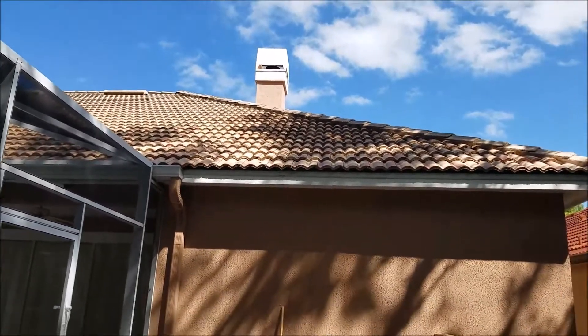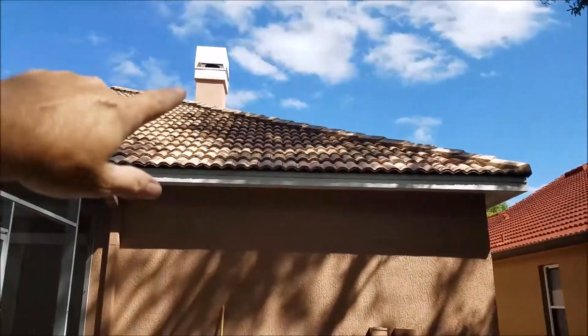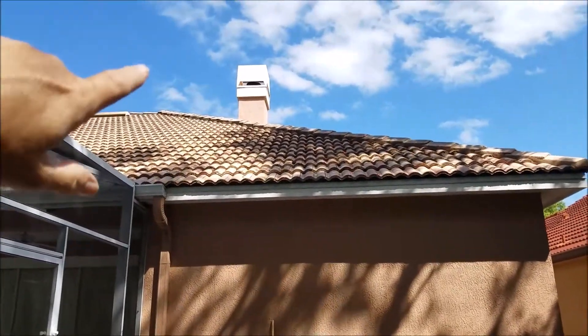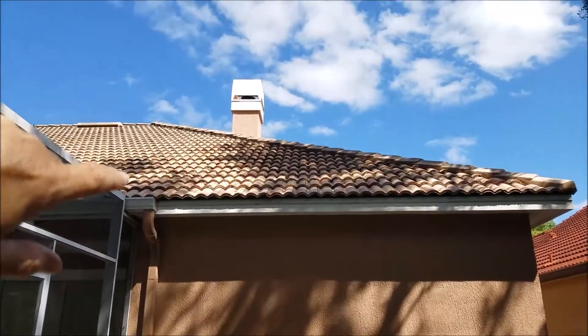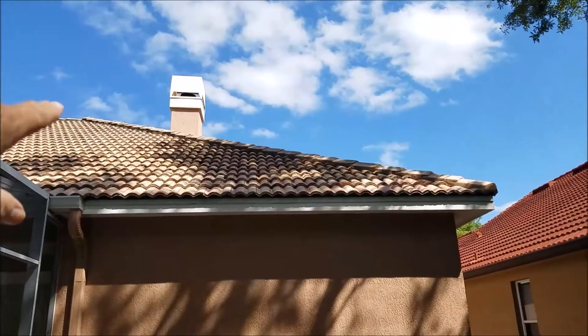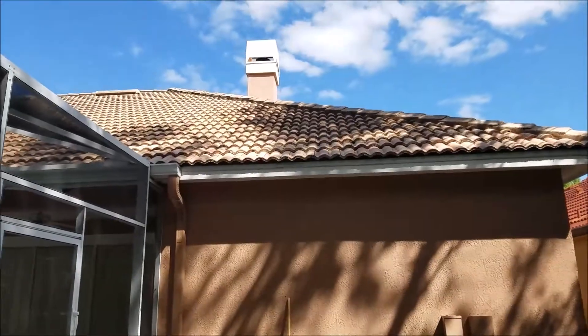Up on the top, if we do this repair on this area here, we've got some hip that's loose. We need to remortar and reseal — use the RT or the 5000, either one — and seal those tiles back, then remortar and repoint the side of it.